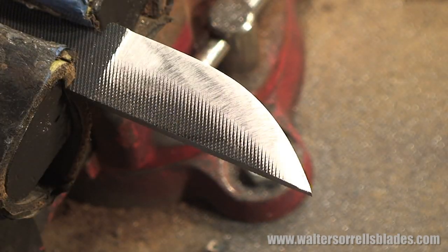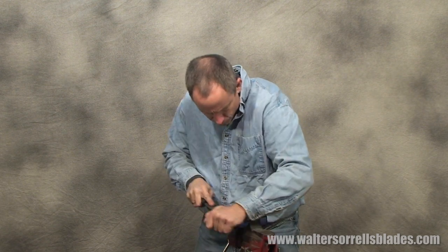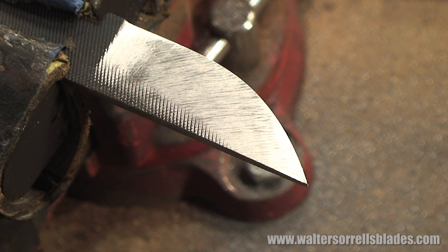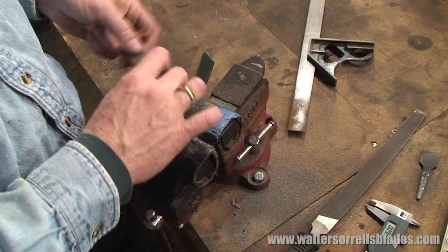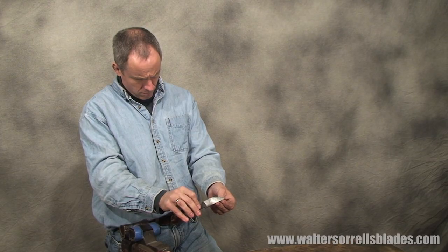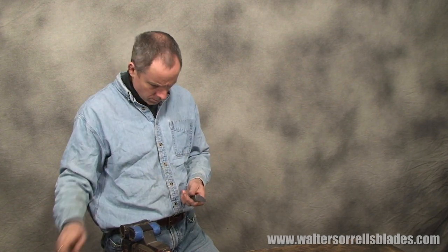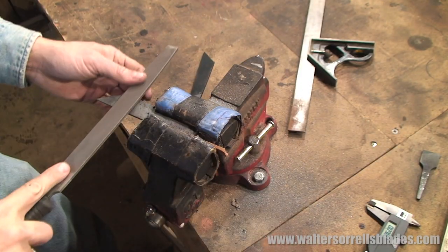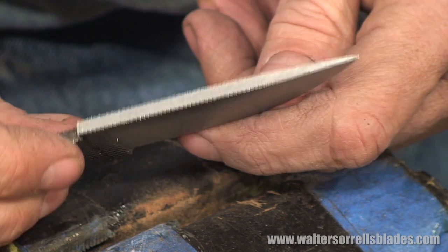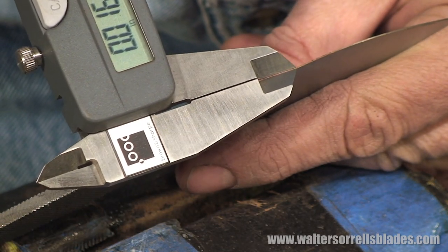This is very boring, labor-intensive work, but c'est la vie. Just keep working away, concentrating on keeping those bevels nice and flat. The other thing you want to do is make sure that the bevels are symmetrical from side to side. If the angle of the bevel is exactly the same on both sides of the blade, you should get a bevel that reaches the spine in exactly the same place. If you goof up, the bevel might reach the spine up near the tip on one side and down near the tang on the other — this will look really amateurish. The good news is that you're going very slowly, so if one side's not meeting the spine at the same place, just keep adjusting until you're nice and equal on both sides. Once we get everything symmetrical with the bevels nice and flat and a consistent edge, then we're done with all the filing.